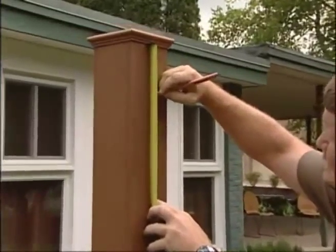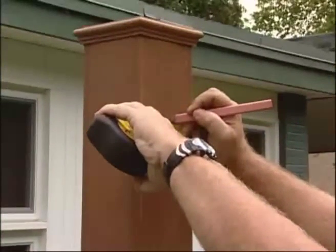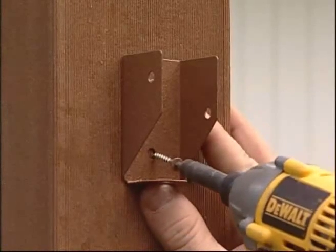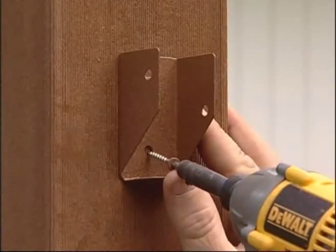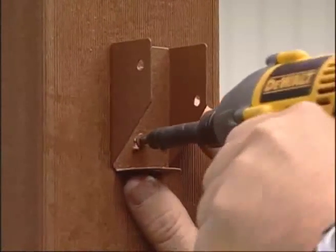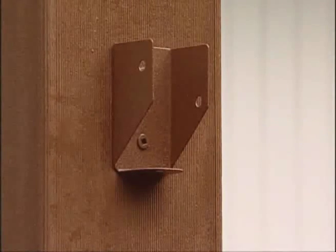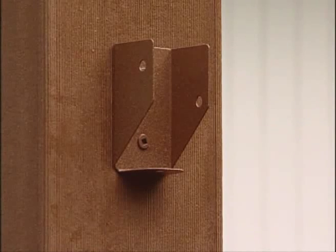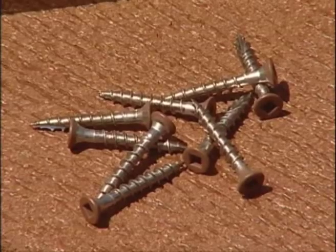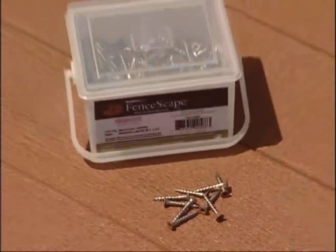Set your rails so that the fence boards do not extend more than 6 inches from the top or bottom support rails. Rails can be attached using FenceScape's powder-coated, color-matched rail bracket. Fasten the bracket into the 5-1/4-inch by 5-1/4-inch post using two No. 8 1-1/4-inch stainless steel FenceScape screws with color-matched heads. Pre-drilling is not required. The screws are a No. 305 stainless steel screw with a modified head, no ribs, coarse thread, and type 17 point.